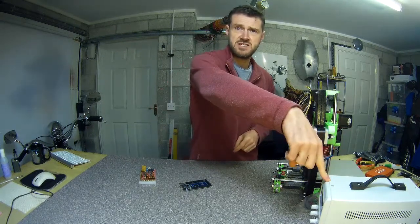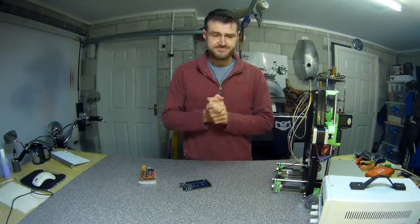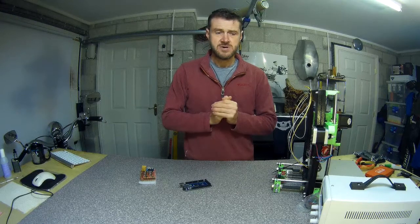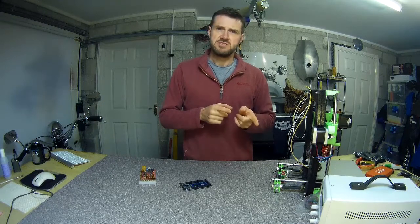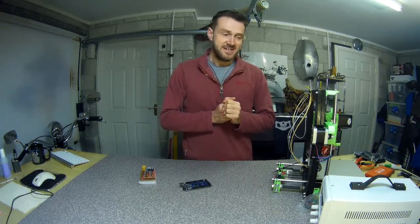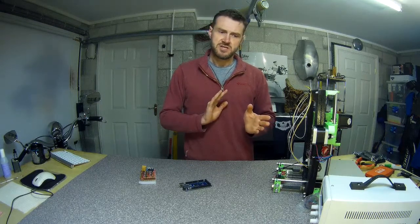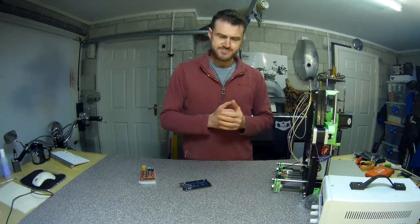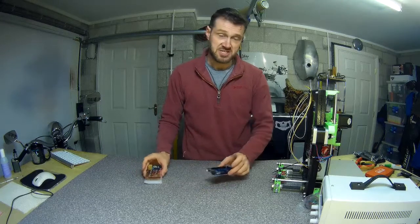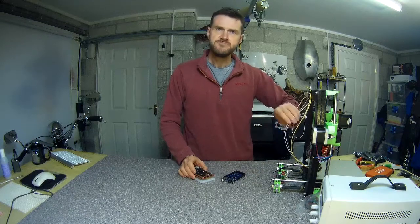To begin with, this bench lab power supply is what I'm going to be using. The end goal really is that I definitely want the heated bed to be 24 volts — whether or not I go the whole thing at 24 volts, maybe, I don't know yet. To begin with I'm just going to do everything at 12 volts to get things up and running, because these electronics really aren't of the highest quality, so we'll just do things as they're intended to be.